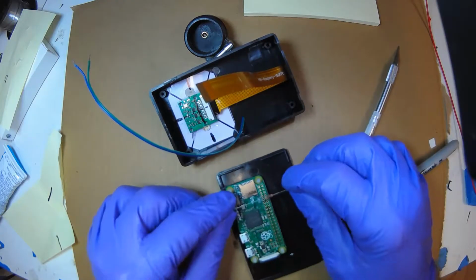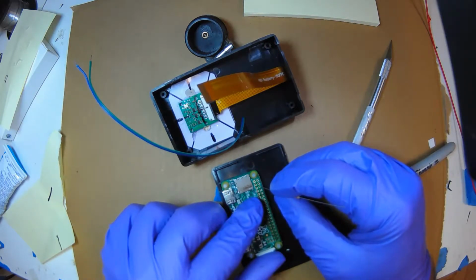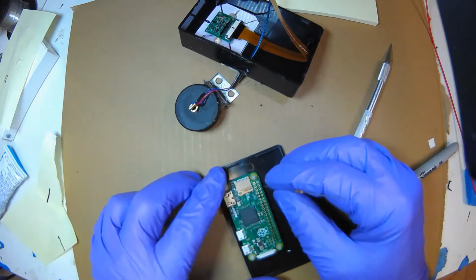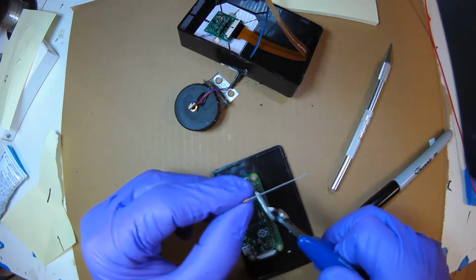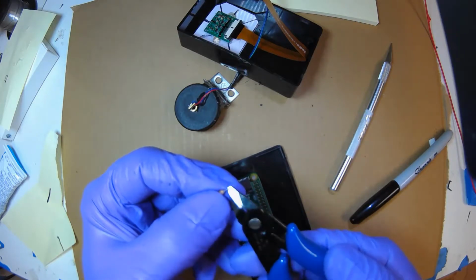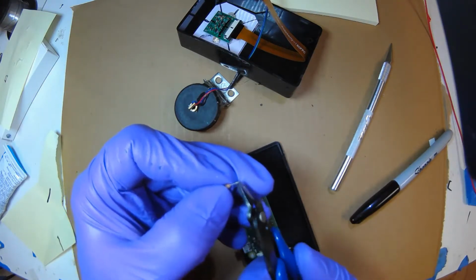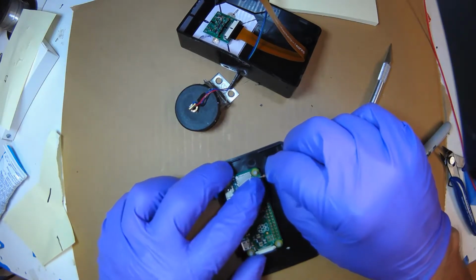So what I'm going to do is attach the resistor to the first hole, and then hook the ground wire. Let's see, on this, the blue is the ground wire to the ground. So I'm going to trim this, and I'm going to make a right angle by holding on and bending it. See the right angle? And I'll cut this one, and I'm going to make a full loop. There's the loop. The reason I'm doing that is, see, this can drop right down there, and I can solder that.